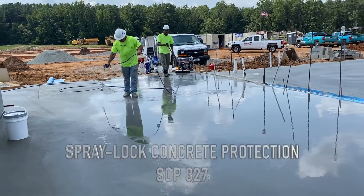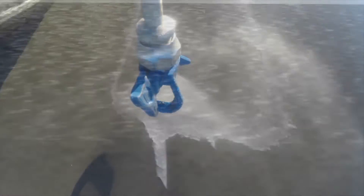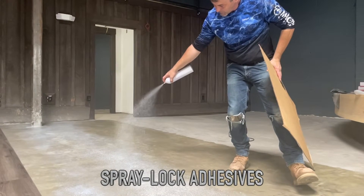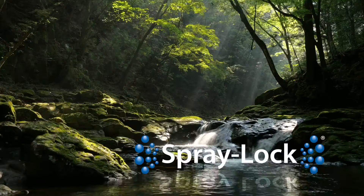Thank you, Josh. I appreciate you sharing that — I thought you guys might enjoy this deeper dive into the concrete side of things. Since we have companies on both sides of the spectrum — a concrete treatment company that specializes in waterproofing the matrix of the concrete so that moisture movement stops, keeping moisture contained so it stays healthy, and on the flooring installation side with the adhesive company — while our adhesives have tremendous moisture resistance, there's always a slab from hell, and it sounds like the plastic sheet test is a great one to use if you just really want to know if you have a problem or not. Thanks for taking a few minutes to listen to this.